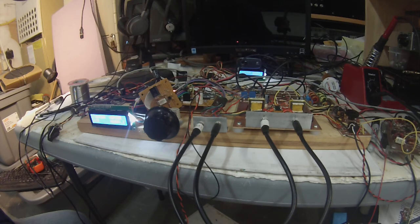So we're looking to maybe use the RADIG board without a computer, just have a simple display and build some phase shift networks. I've got a couple ordered from QRP Labs, although I think they're going to probably require some pretty extensive modification. I'm kind of documenting that on my blog, n6qw.blogspot.com, and I did get the AD9833, which is a little board like the AD9850, but with much more limited capability.